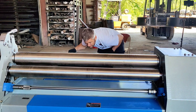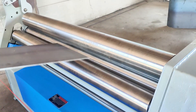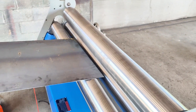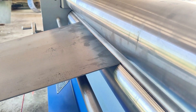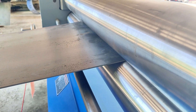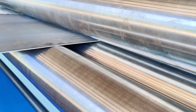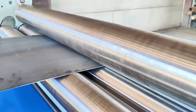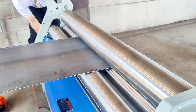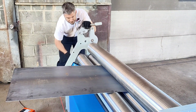Once the pinch roll is adjusted, go to the back side of the machine and perform a pre-bend. Insert your material workpiece into the starting groove in the pinch roll — that's going to square your part. You want to square your material against the starting groove. Once it is in that groove, you can raise the bending roll to achieve the desired diameter that you need and look at the mechanical readout or the electric digital readout to find your number.